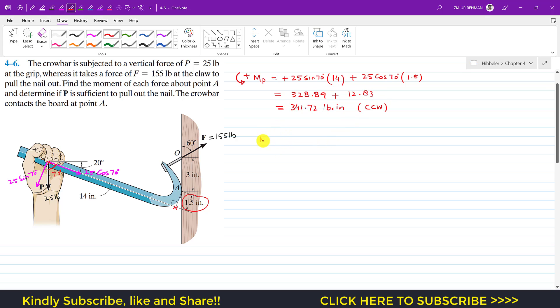Now to find the moment of force F about point A, assuming counterclockwise is positive, we can use the scalar product F times the perpendicular distance, rather than applying Varignon's theorem, since we are given the 3-inch distance. Drawing a line from point A perpendicular to the line of action of F, that 3-inch segment is the reference, and F is perpendicular to the line drawn.